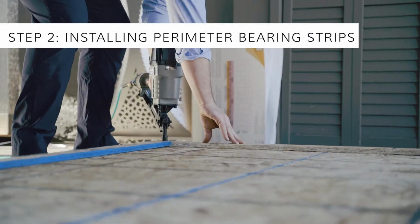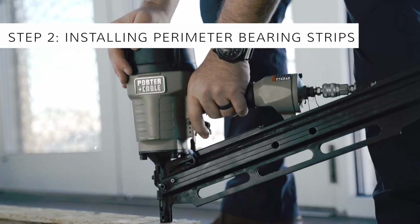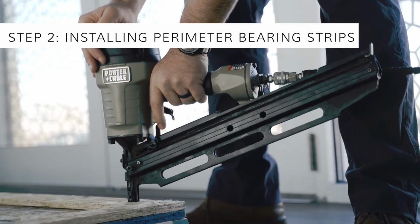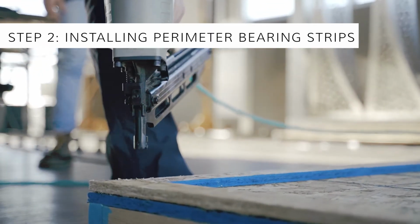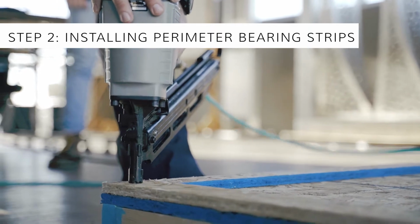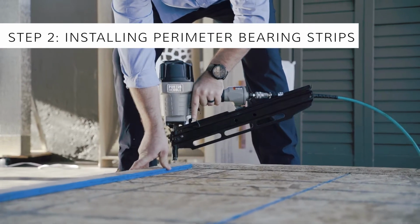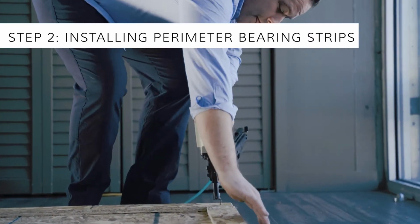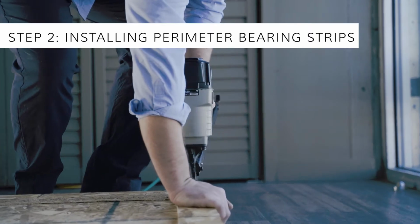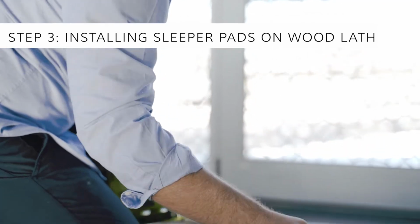We're using 5/16-inch wood lath, which, added to the 1/4-inch pads, means the strips we're using here are 9/16 inches thick. Fastening frequency is not critical, since the walls that follow will be fastened all the way through to the framing member and hold everything together. We're using only a few, since we'll be taking this mock-up apart later to demonstrate the results of our moisture test.